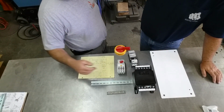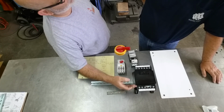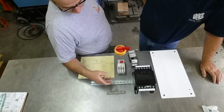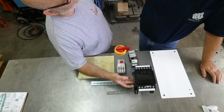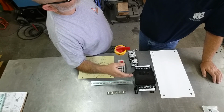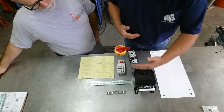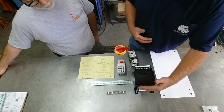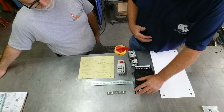I do know. Because there's no direct wiring connection through the transformer. It's just magnetics, right? So what you need is a physical grounding to ground the low voltage side of the control power, correct? Yes. Sort of. Okay, fill in the blanks here. Well, like you said, it's just a magnetic field. If we split this in half from the primary to the secondary, on the secondary side, this transformer doesn't know which one to make neutral.